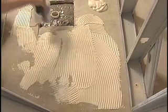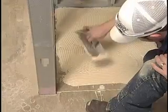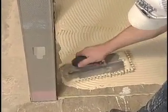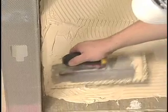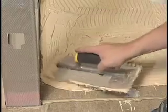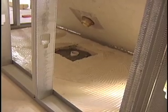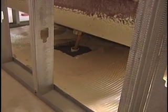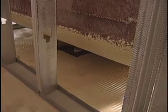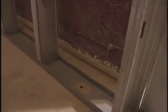Apply a good quality adhesive using a one-quarter inch to three-eighths inch notched trowel to cover 100% of the floor area where the shower will sit — we recommend the wood flooring contact adhesive. Make sure the adhesive is applied all the way to the black line. Use a spatula to wipe the adhesive to an even thickness of three-sixteenths inch across the installation area. Move the shower into position in front of the framing pocket, lean it forward, move the threshold into final position, and lean the shower back into the pocket. Align the drain fitting into place, making sure the drain pipe is not pushing up on the bottom of the shower or the no-caulk drain hitting the side of the drain area cutout, placing upward pressure on the drain area.